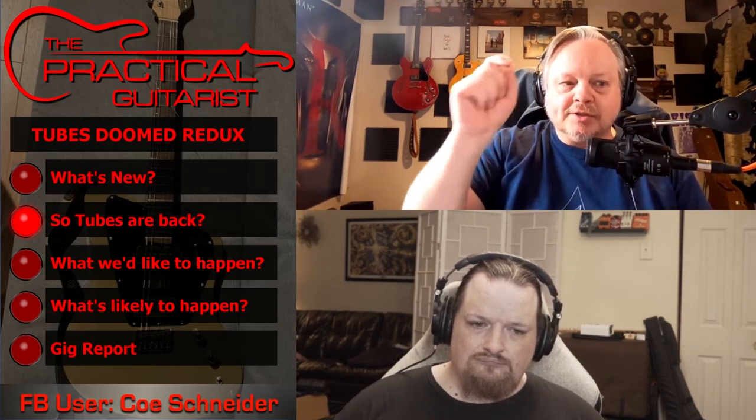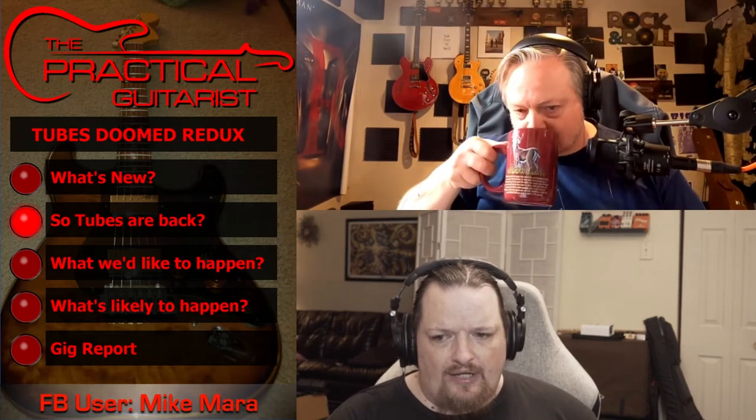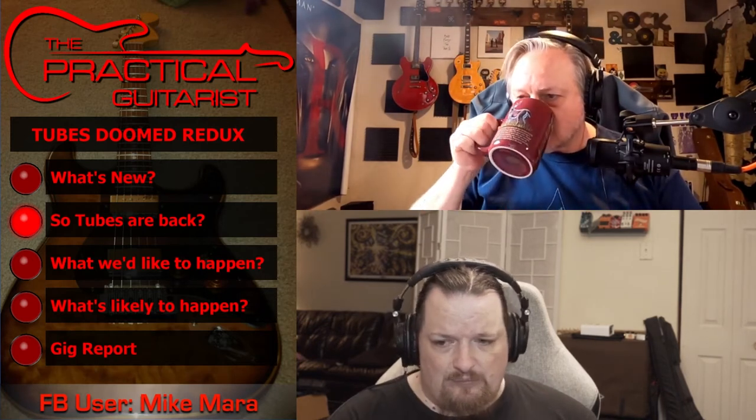There's a lot of people still under the impression — and this goes back to what we were talking about with the Kemper and Axe FX — that the bedroom player needs to change their tubes. Realistically, you don't. If you have an attenuator and you're running your amp really hard through it, that's equivalent to being on stage with the amp turned up. But even doing that, you can get five or six years out of a pair of tubes most of the time before they break. Occasionally you'll get one that gives up the ghost and it might take the other one with it, or even take out your output transformer — that's the price we pay for good tone.